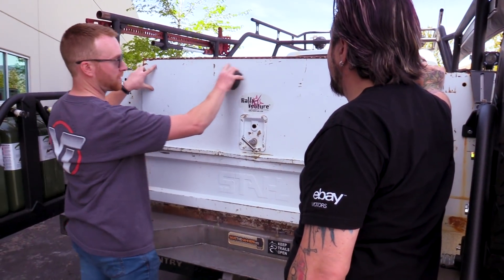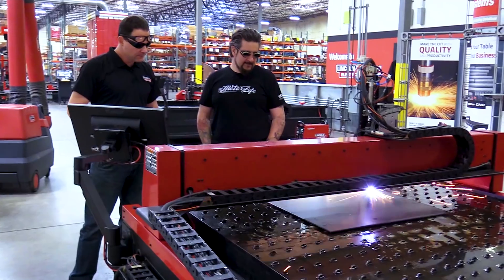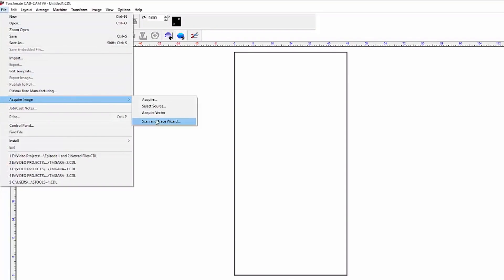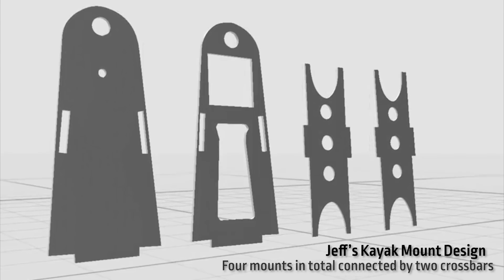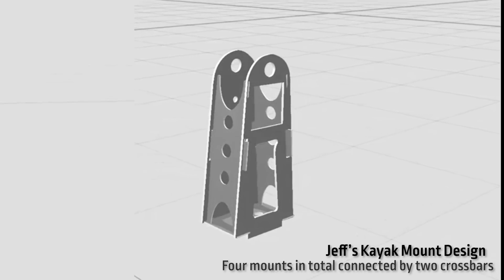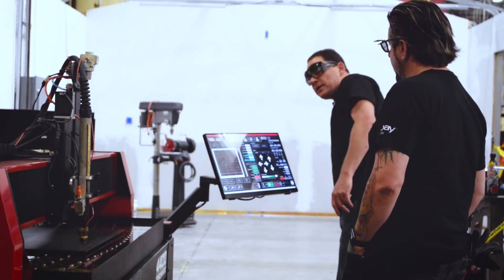Iggy starts drawing up a design for the back hatch, and I team up with Chad Spradlin, the head trainer here at Torchmate, to take Jeff's drawing and make it a reality. Chad uses the scan and trace function in Torchmate CAD to vectorize the drawing and turn it into a DXF file. Jeff explained that his design consisted of four sides that come together and fit like a jigsaw puzzle, as well as a bottom piece that will mount onto the truck. With the file ready to cut, we head to the Torchmate 4400.